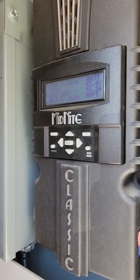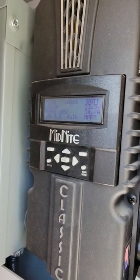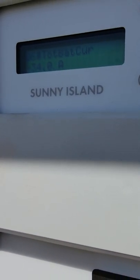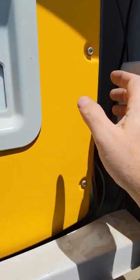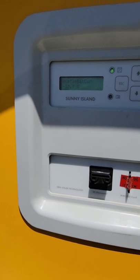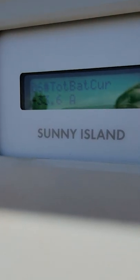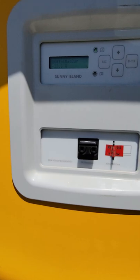The controller is up and booted, so now I'm going to turn on the breakers one at a time with a pause between them. You can hear the clicks and see the amperage starting to come in, voltage increasing. It looks like we've got 121 volts coming in with about 34 amps. And check this out — if we come over to the Sunny Island, Battery Meters, total battery current sensor which is number six, it says 34-point-something amps. The calibration of this shunt now allows the Sunny Island to know exactly how much energy is getting passed through to the batteries.